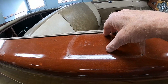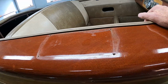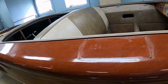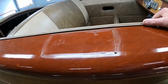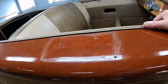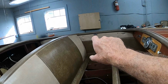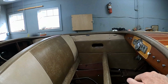No, particularly on something like a step pad or a piece of deck hardware. Your screw head sinks into a countersink. You jump from an 8 to a 10, and that head is going to stand proud of whatever the piece of hardware is. Secondly, you're already just about penetrating all the way through the wood with a 1 inch screw that was in there initially. Why go to 1.5 inches? All you do is have a very sharp point of a screw penetrating through. And if anybody ever, let's say, tried to take that piece of ceiling off and reached up in there unwittingly, they could rake their skin with those screw points.